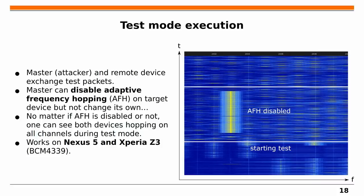If you combine this with disabling adaptive frequency hopping, you can force the target device to stop hopping for a while, then jam a selected frequency. Since it's a combo chip, you could also jam a specific Wi-Fi frequency the device is currently using on the same antenna. We confirmed this works on the Nexus 5 and Xperia Z3 because they both have the BCM4339 chip; it may also work on other devices with that chip.